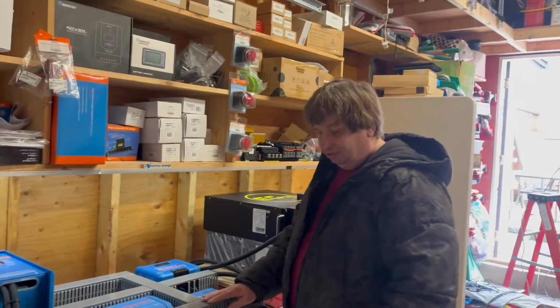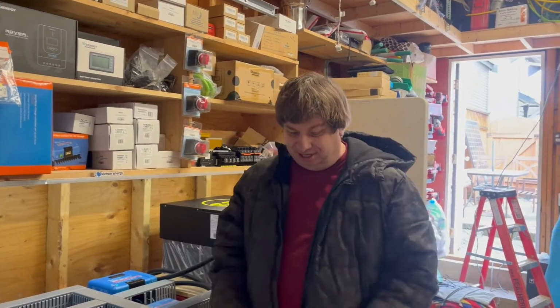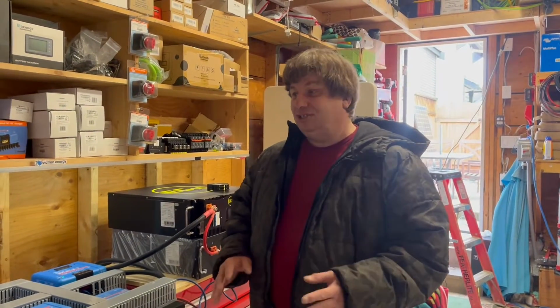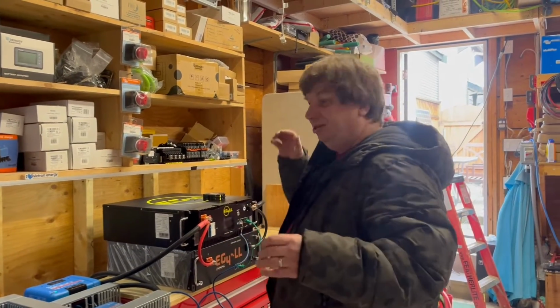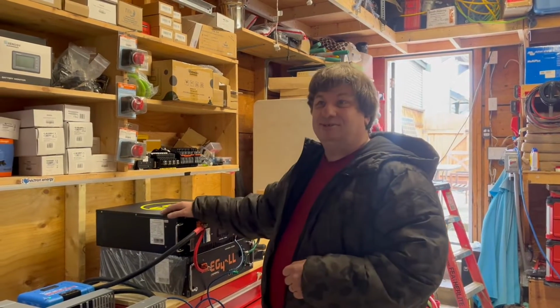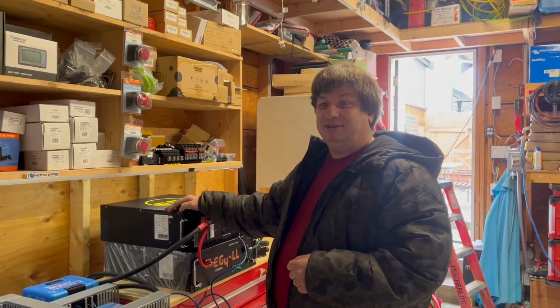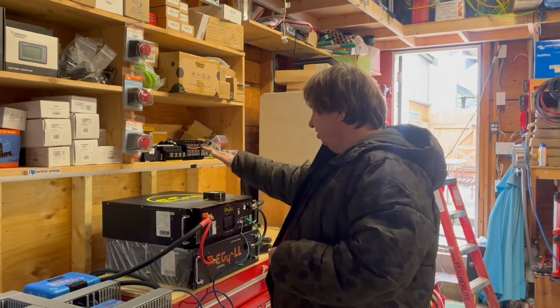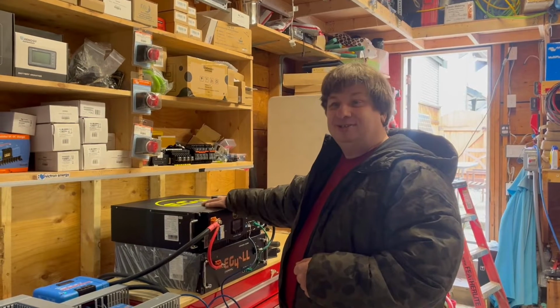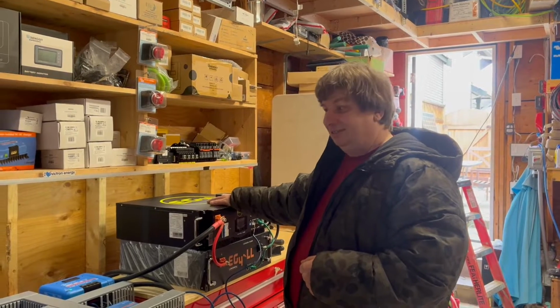The heat gun is called a resistive load. It does not have a big inrush, so it can handle it. It's not an issue. It just can't handle the big surge of a compressor. Or if you've got power tools, whatever, in your cabin, we would suggest getting a version 2. It's just a way better battery, with a way better BMS that can handle way more power.